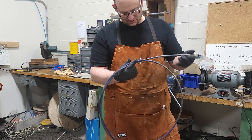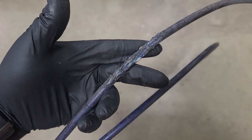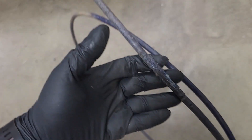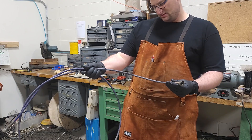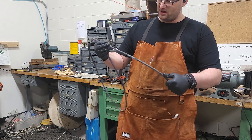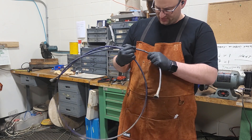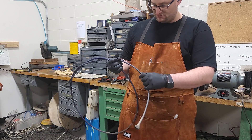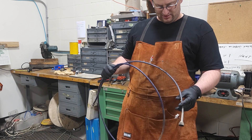Now the customer had said it's been grinding around, and as you can see right here, it's been bent too far, and it's partially melted, and the casing is cracking everywhere. So this is definitely in need of replacement. What he has requested is a 90 degree adapter to go on the transmission side so that he cannot put that kind of bend back on the cable, which is good because it's clearly interfering with something. It might be hitting some exhaust tubing, but this is melted and exposed and the casing's all dry and cracked.